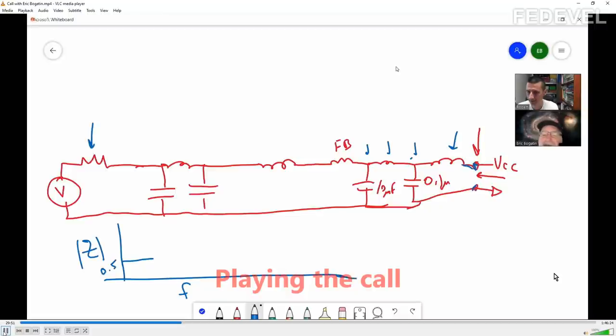I don't know where that is, because this inductor is part of the interconnect. It's the path getting from the pads where we're doing the simulation from to where the nearest capacitor is. Just roughly, it's about 20 nanohenries per inch of path. What do you think? Maybe a quarter of an inch, maybe half an inch of surface trace in that loop, going to the nearest capacitor? Would it be half an inch? Half an inch, I don't know.